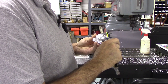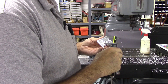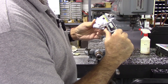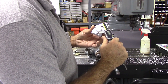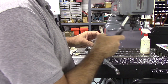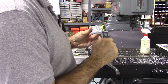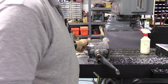Let's check the diamond. Hope you can see that's 1.25 that way. Got some schmutz there. 1.2505 that way. I may not have it exactly right. Wipe that off. Okay, yeah, so that's within half a thou. Let's check this one. 1.90. Hopefully you can see that. So I'm pretty happy with that part on this knee mill. This machine is actually in pretty decent shape.